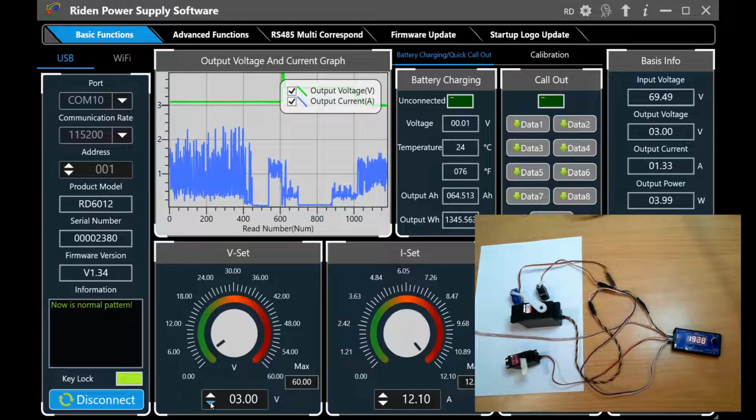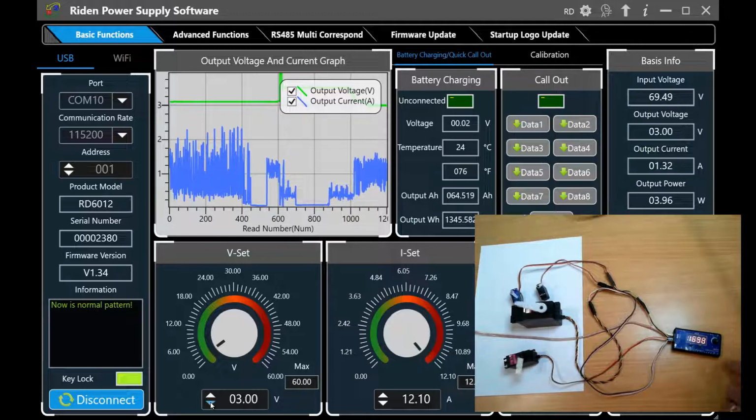So if you're running quite a significant number of servos off a shared power line of low power, you could be looking for trouble. Now, I haven't actually got a voltmeter showing me what's coming off the servo unit itself, just what I'm feeding to it, but the cable I'm feeding to this is actually a fairly significant cable.